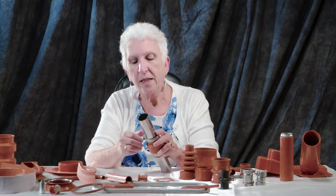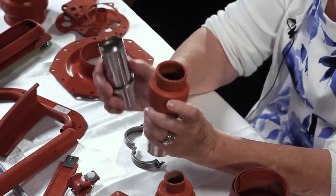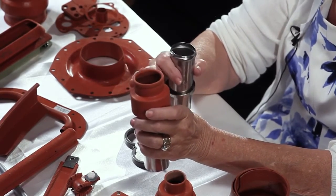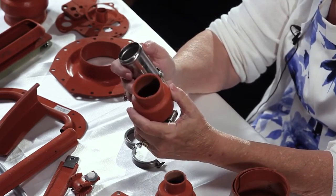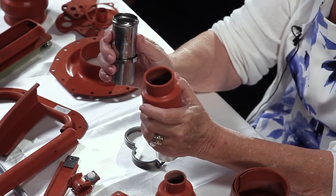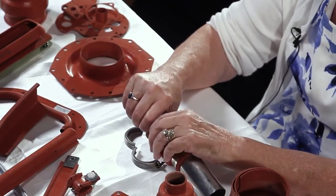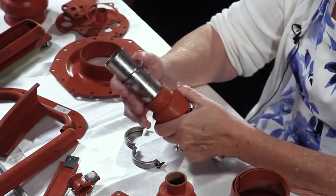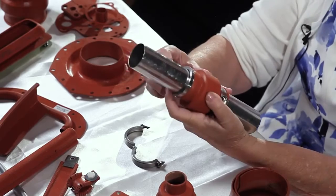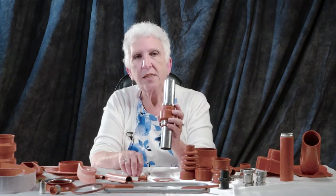So what we did instead is we took from our metal connectors, which I will show you shortly, and we changed the configuration of the duct. We added, instead of a lip, we just made it a radial seal, which is just a dimensional change. Designed to fit over an MS33660 bead, it pops right over it. Nothing we make requires a tool to install it or take it apart. And then we added two pieces that are actually life of the equipment. One is a compression ring, which simply is pushed over the lip of the seal against the bead. This is now a sealed system.